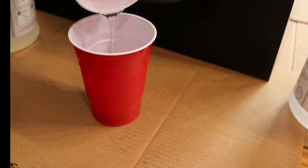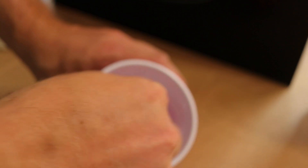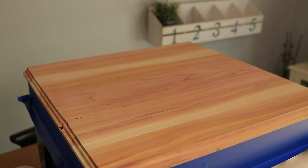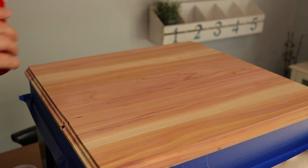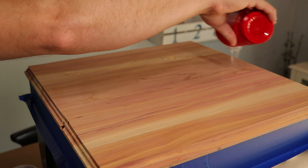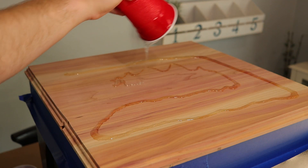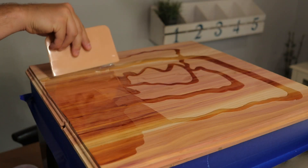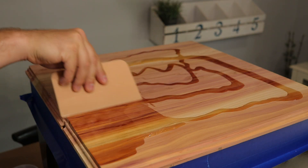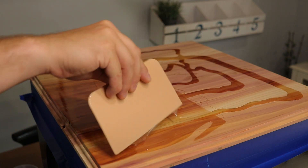It's epoxy time. I love using this particular epoxy because it's a one-to-one ratio — very easy to measure and mix. I decided to epoxy just the tabletop, doing a light skim coat first, then a flood coat after that dried. I had some blue painter's tape lifted over the edge so that any drips would fall away from the black paint, and for the most part that worked well, though there were a couple of spots I had to clean up.